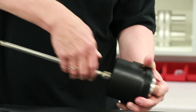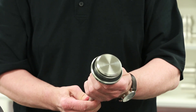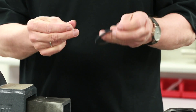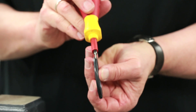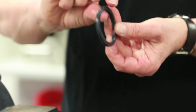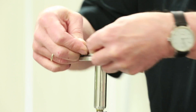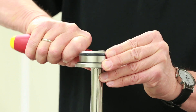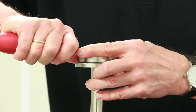Undo the locking screw and remove the valve shaft. Inspect the seat seal for an even fit. Secure the valve shaft in the vise once again, ensuring the jaws are covered with aluminum or copper to protect the valve shaft from damage. The next step will demonstrate assembly of the lower seat seal. Apply a thin layer of grease to the seat seal, making sure the radial seat seal is installed in the correct orientation. Place the seal over the groove as shown and ensure it does not twist. Use a flat screwdriver with smooth round corners for assembly of the new radial seat seal. With the tool, press the seat seal down into the groove with your thumb, pressing in small alternating increments as shown, and check for an even fit.